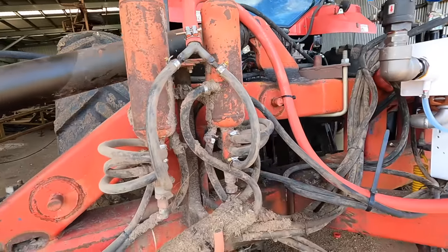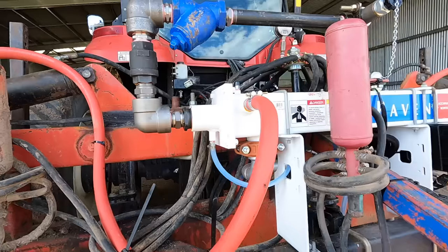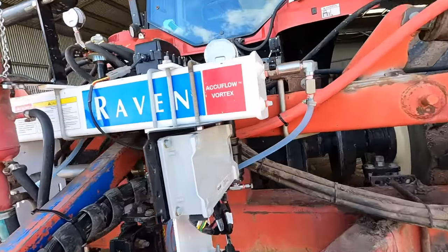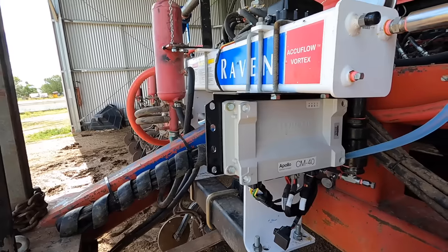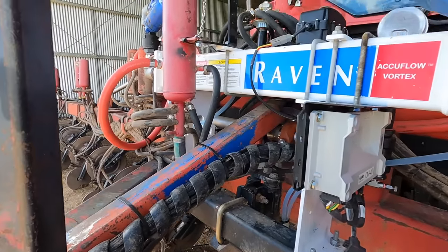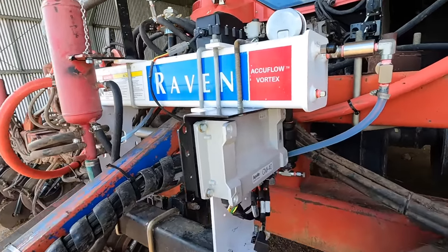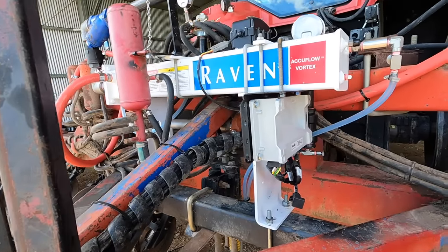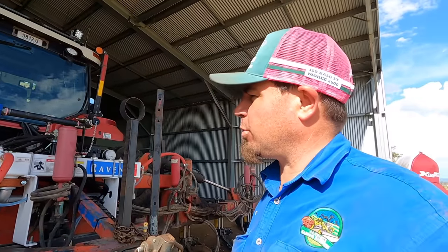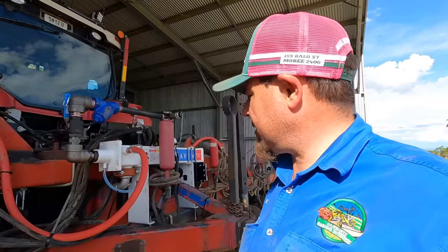A little bit of bleed-off goes down those pipes and distributes throughout the bar - we've made up those little fancy wire bits. It's been a couple of days project between the electronics and everything. This electronic box - the Apollo - is like the same one we put on our air cart. It basically controls your whole system. It's a Raven valve and Raven flow meter, and the boys sorted that out so our Topcon Apollo controls it. I wanted to get it done before Christmas and we have, so hopefully the first week of January we'll get into gassing once all the boys come back.